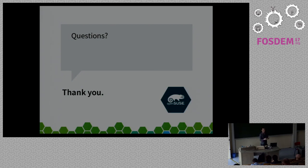The question was, how do you manage accessing the configuration again? This is something Lenz asked earlier. Basically, if the board or the gateway comes up and can't access the Ceph cluster using the configuration that was provided, then it returns to exposing a configuration file system. It also copies the log onto the config file system, which is quite cool for debugging. So you can see it processed the config, couldn't connect to the Ceph cluster, or the image isn't there. This is the error I get, and then you can reconfigure your board at that stage.